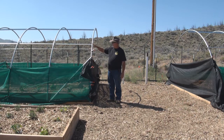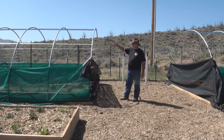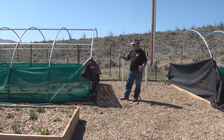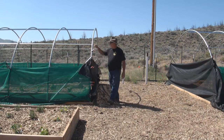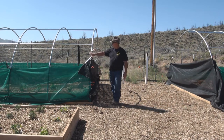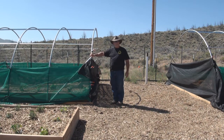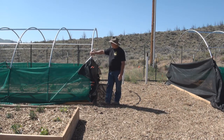Over the summer, I'll work at getting these framed in on the ends with a door on this end. The other two ends will also have vents — high vents and low vents — so I can open them and try to get a little convection flow in there. We also have this material which I ordered, large enough to go over the entire hoop and clip on. What we'll do this summer is run it just like they are as I get the hardware in place to skin it. In July and August, we'll run it with just this material on the top, which is what a lot of people do — they get the plastic off or roll up the sides to get more draft through and get the heat away.